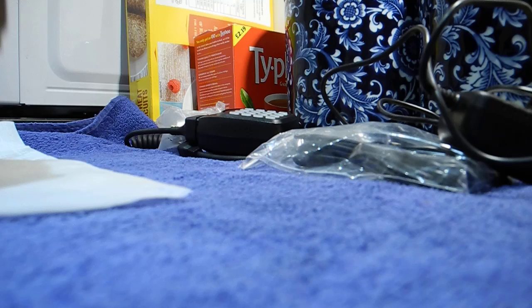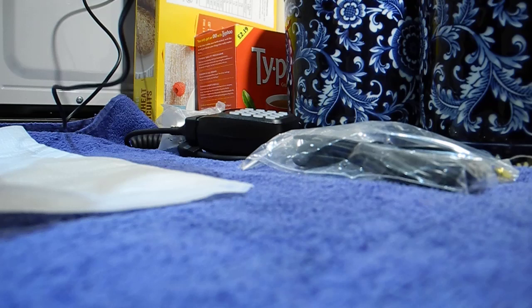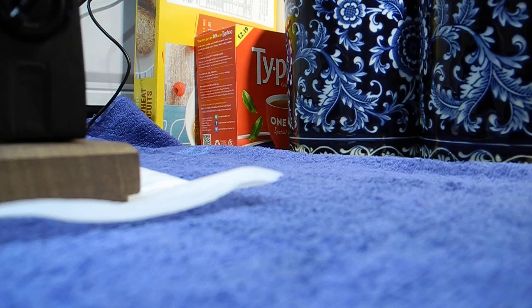The power pack, what we'll have to do is put it in here, because otherwise I'll lose the light if I plug it elsewhere. Plug it in the wall. Be careful you don't break the plastic pin on it. Plug that into the network radio into the back. So it looks like a 3-pin microphone socket. Just plug that in. The microphone then plugs into the front. Don't bother with the GPS antenna. I'm not going to bother with it. You plug the microphone into the front.